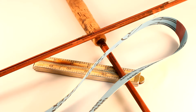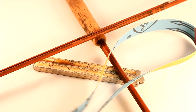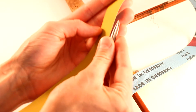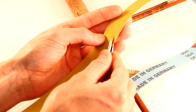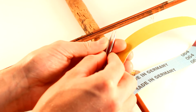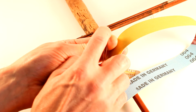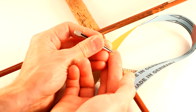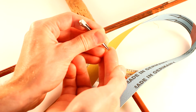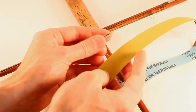The second very important step — which I really couldn't capture as I was grinding — is to sand the internal portion of the tweezers. Here's what I mean: with the belt running on your sander, slide the tweezers in along the side and pinch a few times, cool it down, flip it over, and do the same on the other side. What you're getting out of this is that when the tweezers are completely collapsed, the last eighth of an inch right at the tip is flat and those two surfaces are touching. If that doesn't happen and you're trying to pull out a splinter, when you squeeze it you'll actually just cut it because the tip is so sharp. So flattening it just a little bit at the end is really, really important.